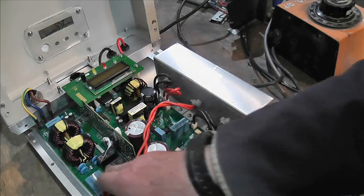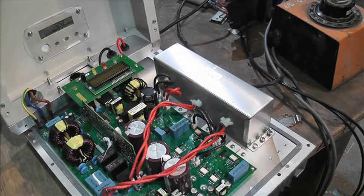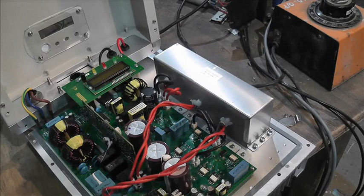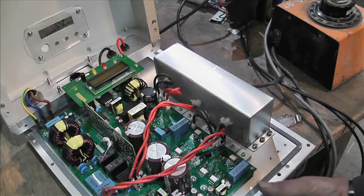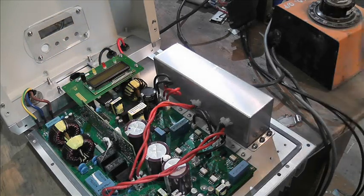Several of the Ever Solars had that relay contact problem. It was early days when people were over-driving inverters because they were expensive, putting a couple of extra panels on so that during winter you got better generation. But in summer the inverters were switching off because they were getting too hot, especially when fitted in lofts — which is a disaster. There's a video about extending inverter life on my solar inverter playlist. This one looks alright though — it's struck up quite nicely, nothing untoward, and this huge heatsink is a very good thing.